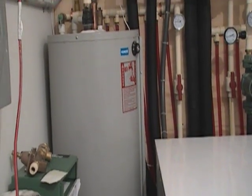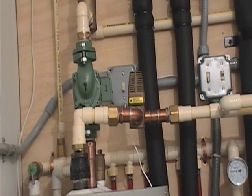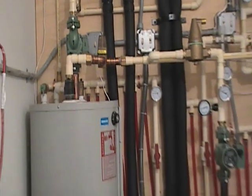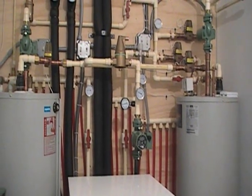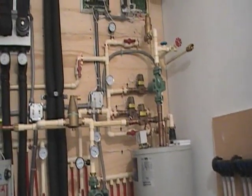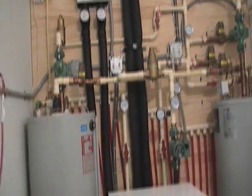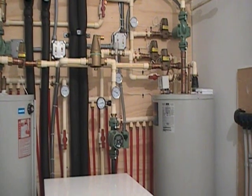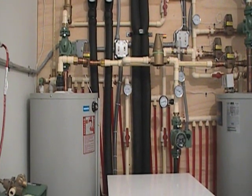When looking for cooling, this pump circulates cool water through the floor for radiant cooling, which isn't typically done. It does involve some consideration of humidity and dew point in the house. We put a whole-house dehumidification system in here to control humidity levels. There's still a little bit of work to do — a fill valve needs to go in and wiring still has to be completed. Based on engineering data provided by Water Furnace, we are running at a coefficient of performance of about 4.525 right now.